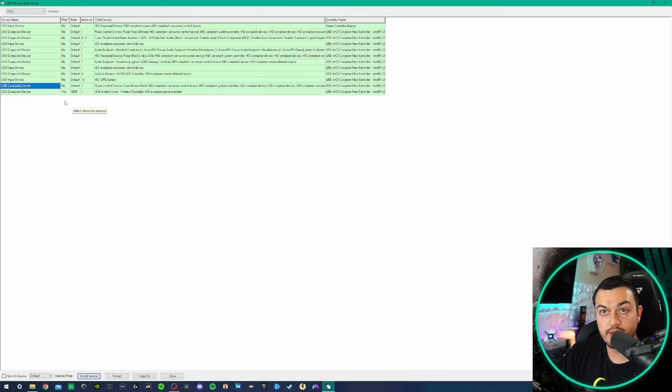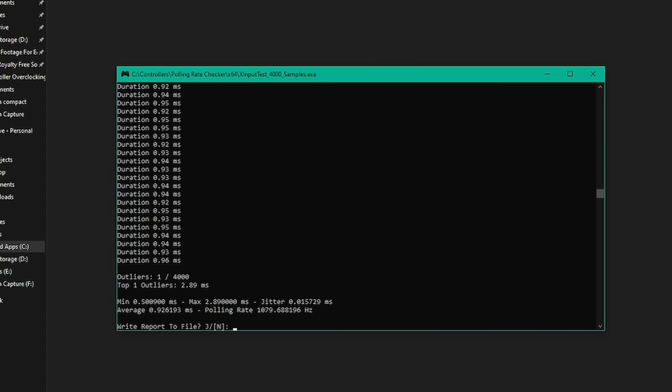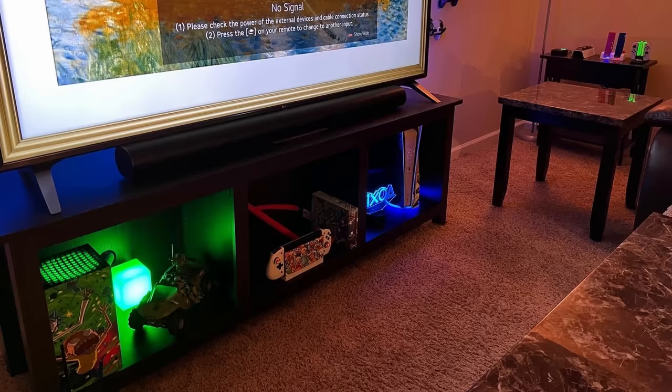The Victrix Gambit deserves another video on the channel. It's touted on the landing page as being the fastest Xbox controller, but without an overclock it really isn't, and the overclock can only take place on PC. Even if you overclock at the PC and bring it over to your console, it's not flashed onto the PCB — there's no memory on those controllers other than rear button profiles. It does use dual-core processing, and I'm going to make another video on the Gambit because it is actually a pretty complicated controller.